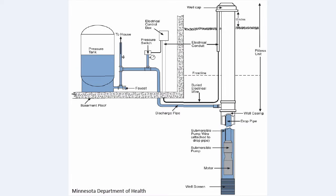This image represents a typical well and water system for a home. In this example, the well has a screen, so it's a well finished in the sand and gravel aquifer. The pump is in the well just above the screen. The pump lifts the water up a pipe, called a drop pipe, to the pitless unit, part of the pitless adapter. There, the discharge pipe elbows horizontally and carries the water into the house.